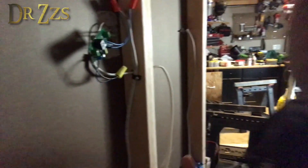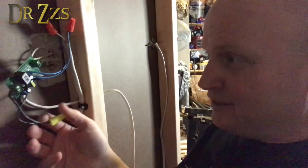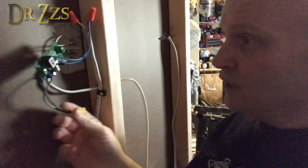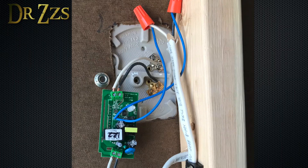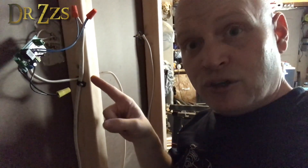Follow that up. Of course, there's no switch box here to make it easier to see. But what we've done is connected the power, which would be from the breaker, to the input side of the Sonoff. This image makes it a little bit easier to see what's going on. Wires from the circuit breaker go to the input side of the Sonoff. Wires going to the light come from the output side of the Sonoff. And then wires from GPIO 14 and ground go to the two wires heading down to the switch box and connecting to the switch. That's it. When all you have in your switch box are the two wires connecting to the switch, this is how you can use a Sonoff.